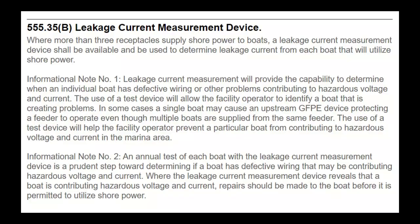What the heck is a leakage current measurement device? It's an ammeter — you put it around those wires. How much current should be coming back compared to the current that left? The same amount. So you put an ammeter around the power supply cord and you see if any current is leaking. Obviously something is leaking because we keep tripping the breaker.